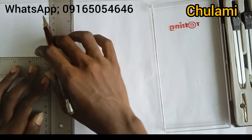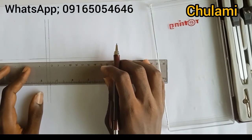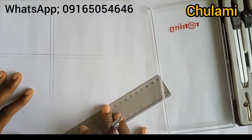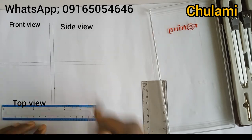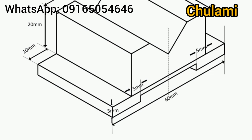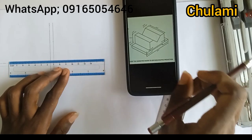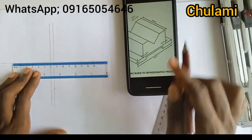Okay, so I've done that and I'll also make sure that it's long. Then I'll also mark this 0.5. I can actually use my eye to gauge it, but please make sure you measure your specific 0.5cm. So after doing this, we are doing some projections — we are placing the front view, side view, and top view in this manner. Looking at the diagram on the screen, you can see the square length is 60mm for the front view. That's why I measure 60mm there.